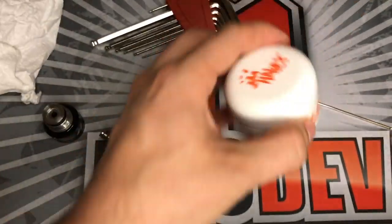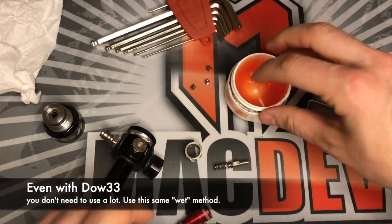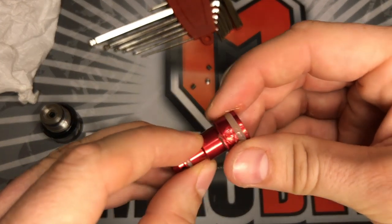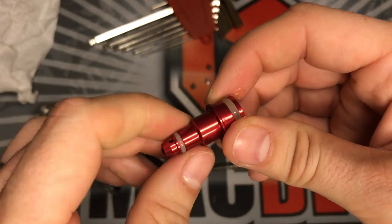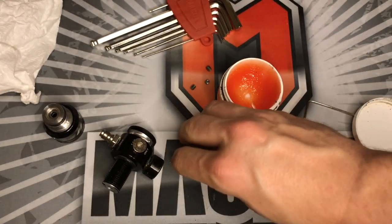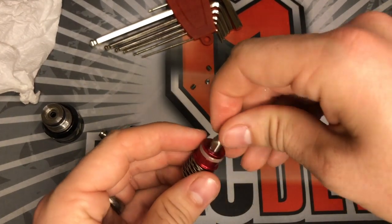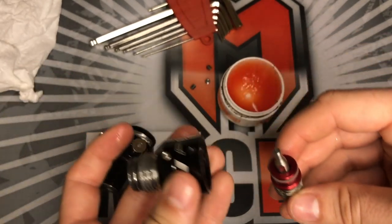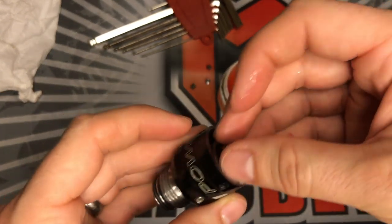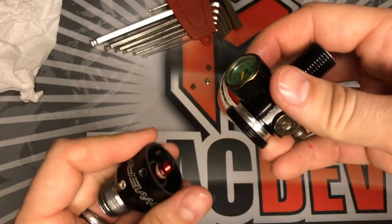Now we're done with the paper towel. With the Marmalade, you don't want to use a lot of it — just kind of dab your finger in there. You just want the O-rings to look wet, so move it around like that. Then take your pin and slide that back in there. Now this part can get a little bit tricky — sliding it in there. You can try to match it up so that way it floats on through. And that's just a matter of doing everything in reverse.